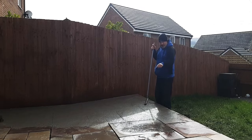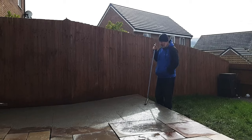So you've got to be careful, because this is rapid set. If you're going to be laying this in summer, say 20 degrees, really, really be careful, because this really goes off quick. So we'll leave it like that for a minute now.